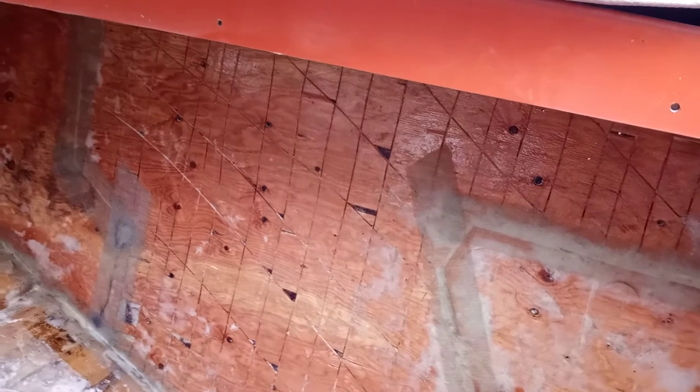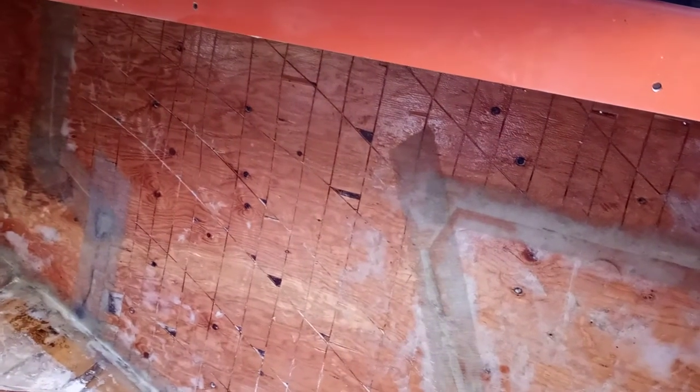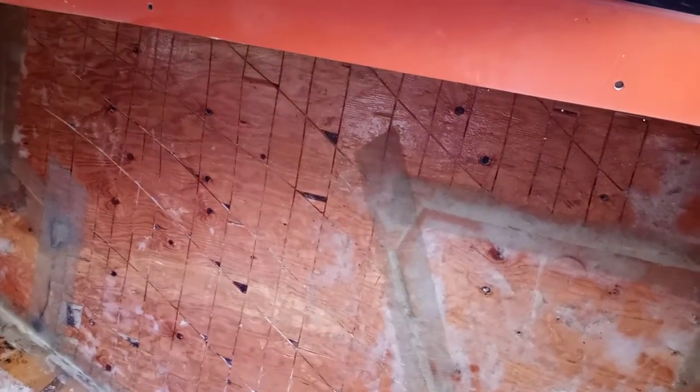And now the beauty is I can screw in this way into this wood. And these are 1/4 inch sheets we're going to do now. So that's 1/2 inch. And then we're going to do 1/4 tab, 1/4 tab, 1/4 tab, 1/4 tab, and that'll give us... and then actually probably another one after that. Peanut butter between, that'll give us about 2, 2 1/4 inches. We can't go anything over 2 1/4 because then our drive won't go in there.